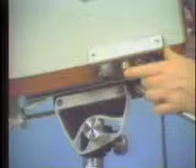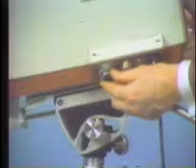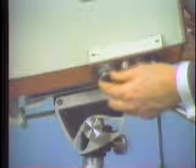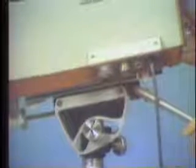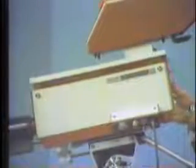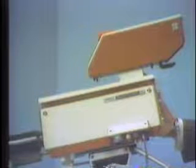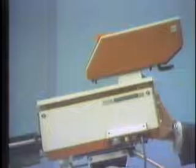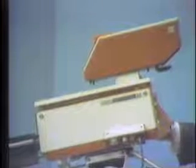For the more sophisticated user who wants to use two or three cameras, we have a multi-pin connector here. This multi-pin connector goes back to a junction unit that engages both the tally system and the intercom system. Later, we hope to introduce a very compact junction unit included in a small compact console, so that we could have the first really small console concept in color cameras.